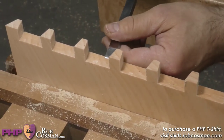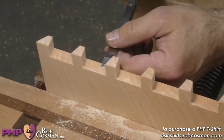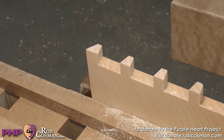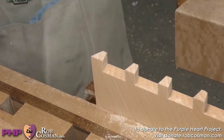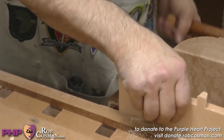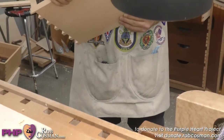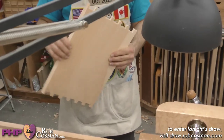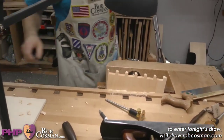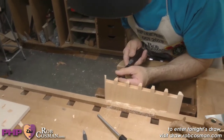Do you put a micro bevel on the 17 degree? Yes, always. It's the easiest way to sharpen. But I keep it low. I don't do much, otherwise it kind of defeats the purpose. It's required that you put a micro bevel on it. I've had a customer buy the chisel, and without sharpening it, he went to use it, and the edge folded. Well, that micro bevel would toughen it up a little bit. It sharpens it, so it's cutting instead of pushing.